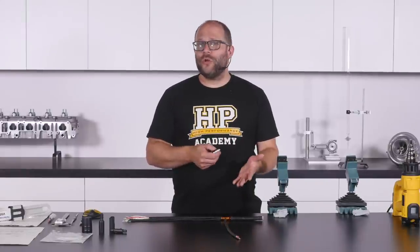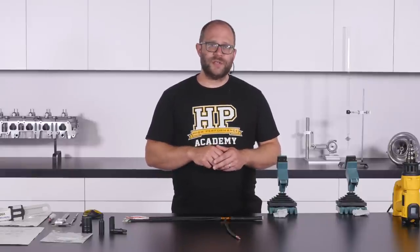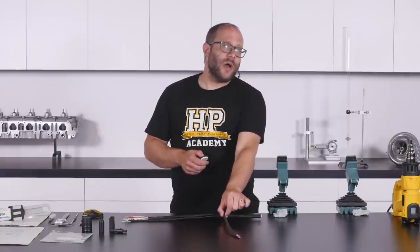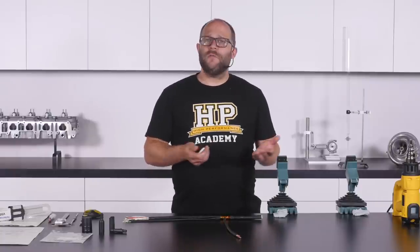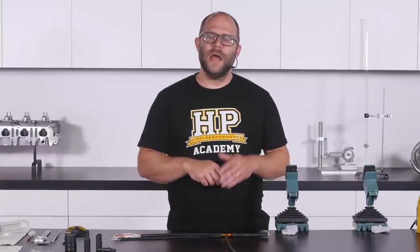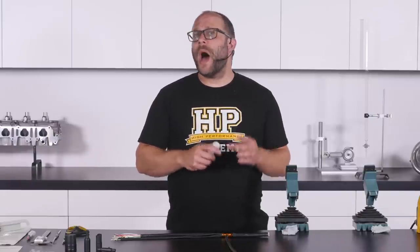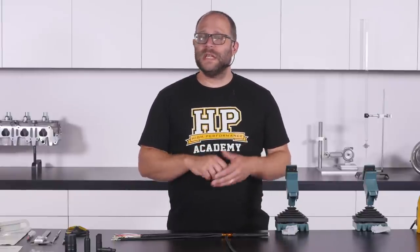In this example, we have three transition point exits with one of them at 90 degrees to the main harness trunk, so we have selected a T-shaped molded boot. Our smallest exiting harness section is the one exiting at 90 degrees and has a finish diameter of approximately 8 millimetres. Looking at the Raychem catalogue, a 301A022 is suitable — its maximum recovered exit diameter is 6.9 millimetres, so it will recover nicely onto our smallest harness section, and its minimum unrecovered exit diameter is 13.2 millimetres, meaning we can install it easily.